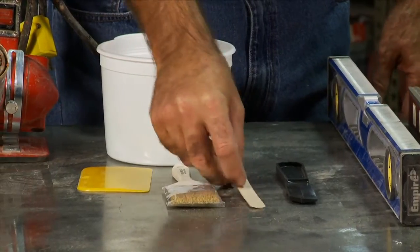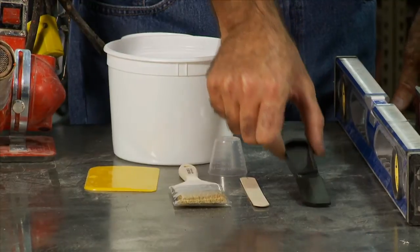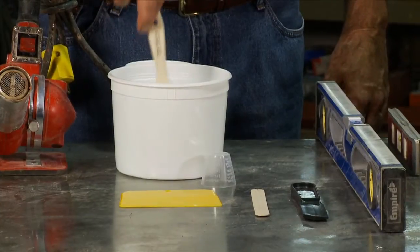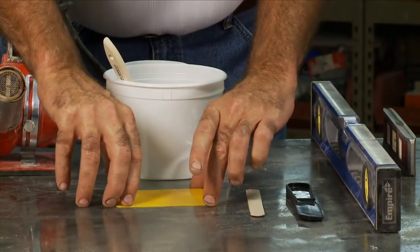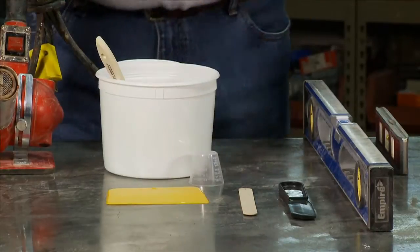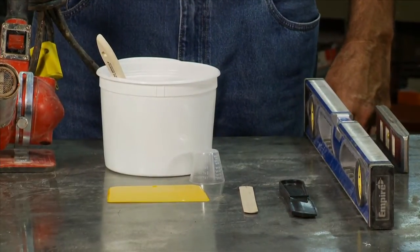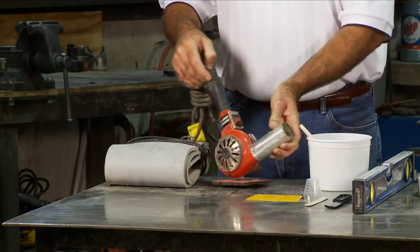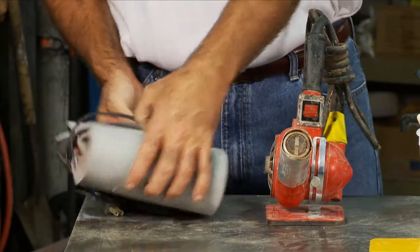Use a wooden stick or a plastic spatula for mixing and spreading the adhesive. Also, a paintbrush with some solvent is useful for cleaning the outside. At the larger sites, we found that a small squeegee, like a Bondo spreader, is helpful for spreading the adhesive. To accelerate joint curing, the use of a hot air gun or heat blanket is recommended.